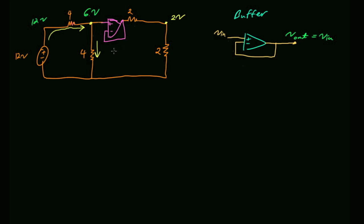Now what happens on the right-hand side of the circuit? Is there any current flowing through it? No voltage, no current? Well, op-amps don't take current in, but they certainly generate current. Don't forget, op-amps are connected to a power supply — they're doing something. Current comes out of the op-amp. How much? Whatever it needs to supply. That's the beauty of an op-amp — it's just like a power supply. It's got transistors inside, and to the extent those transistors can do it, they will supply whatever current is needed to keep the circuit operating at the design point.